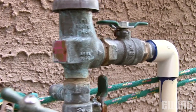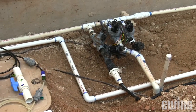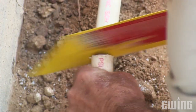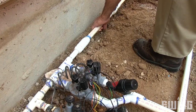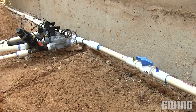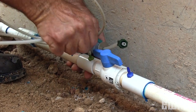The first step to installing your Easy Flow system is to expose the mainline. Make sure to turn off the water supply, then cut a section out for the ball valve coupling. To make the job easier, we suggest using a slip fix on one end. Some Easy Flow models include the slip fix option pre-assembled for added convenience. After the ball valve coupling is in place, attach the included tubing to the barbed fittings on each side of the valve's handle.